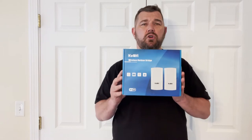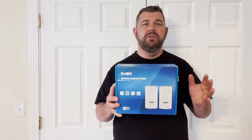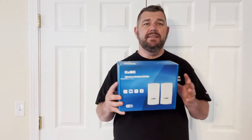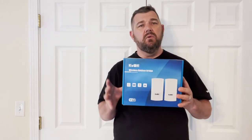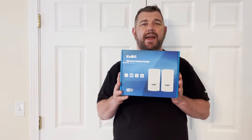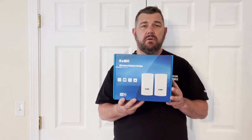We are indeed talking about Kufi — this is the CPE 200 bridge kit. It operates on the 802.11ax platform. These are point-to-point and point-to-multipoint bridges that can see each other at a distance of up to 1.8 miles line of sight. By line of sight, we mean the antennas on each access point must be able to see each other. These are not going to go through thick forests or steel buildings — this is for an outdoor environment where you have line of sight, but if you do, they are phenomenal.